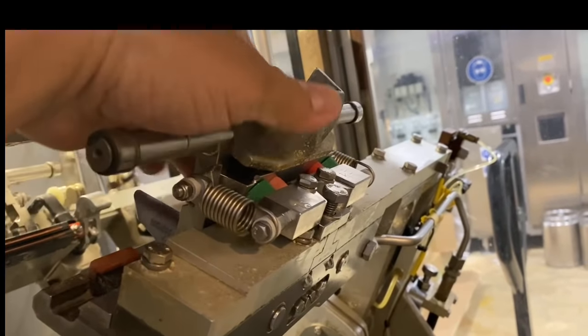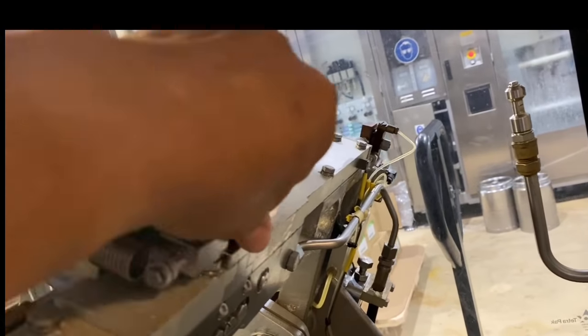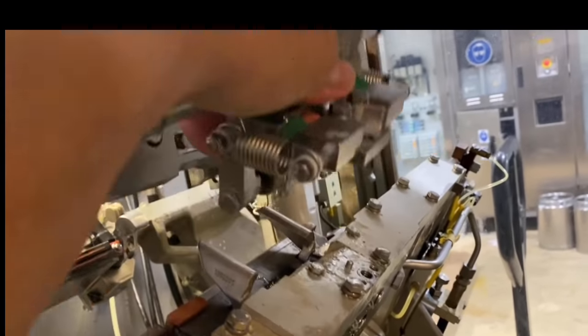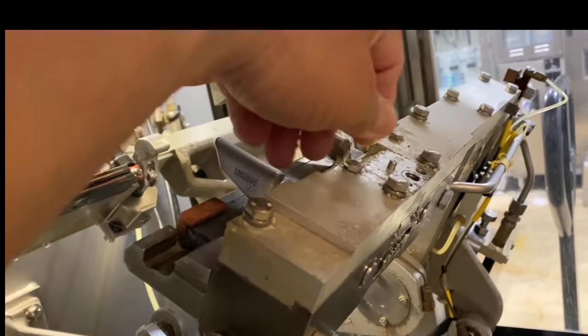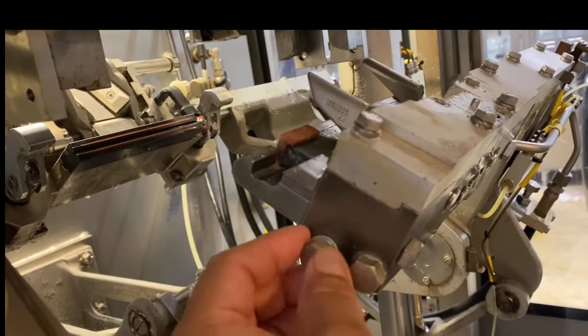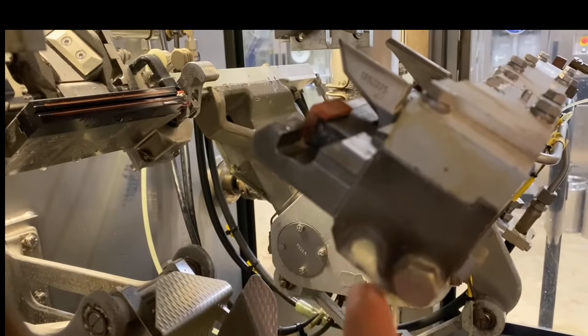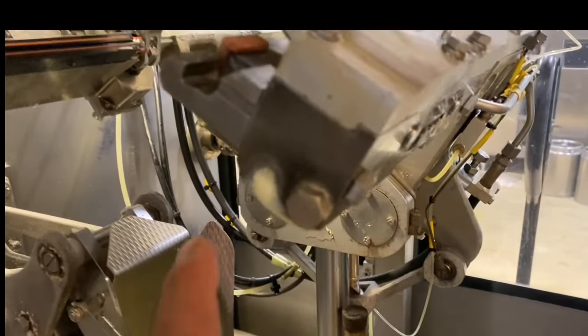First thing you want to do is to remove this volume flap in the cutting jaw. The volume flap, then remove the 8mm screw on top, and number 13 screw on the side, like that, so the oil will drain.